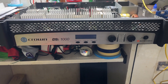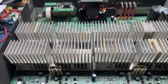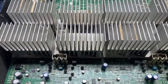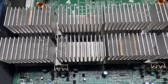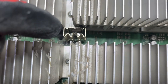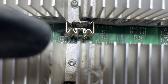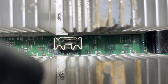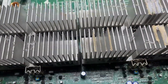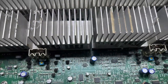I've simply opened the top of this amplifier. These are the metal transistors covered with a heat sink. The very first thing I'll check — you can see there is a transistor, and in front of it there are four diodes. So the first thing I'll do is check these four diodes, and here also — so these eight diodes I'll check, and after that I'll check the metal transistors, and the last ones will be these four transistors.